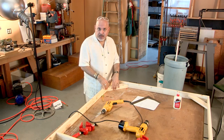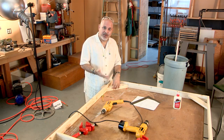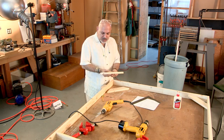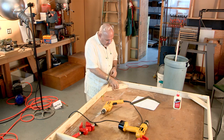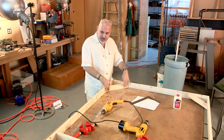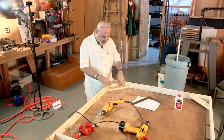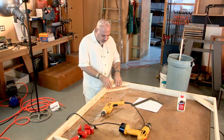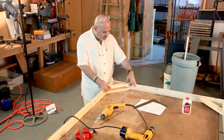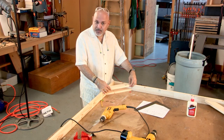Now it comes to the bracing and giving strength to the corners. We've done three of them already and I want to show you the technique I use to make it really easy without having to get a tape measure each time. Using the same wood we use for the frame, you cut a 45-degree angle for a corner so you can get it flush. I use a second piece of wood to put it in the middle so that when we go to use these on set, we can put a C-clamp there. If you put it at the end, the C-clamp is always in the way. Also, if you're using canvas instead of wood veneer, the canvas can show a seam because by the time you paint it, it'll shrink and show an edge, which you don't want.